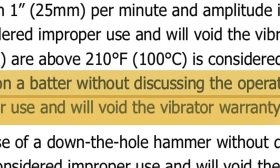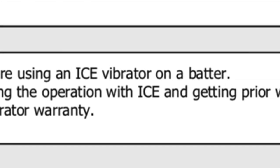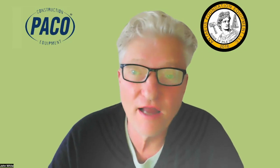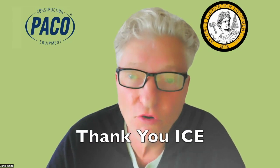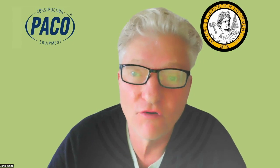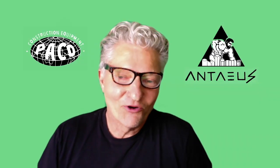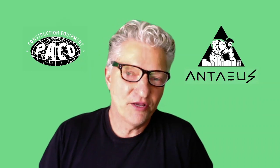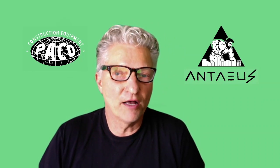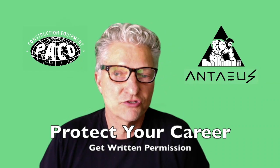When you look in the fine print of the ICE warranty, it clearly states that you cannot drive batter piles without written permission from the factory — otherwise your warranty is void. The manual also clearly states this requirement. This is not a criticism of ICE; in fact, ICE should be commended for at least notifying those who read their manual. Other manufacturers using the same bearings do not even provide that warning. So it's in the fine print — not everybody reads it, but now you are an informed pile driver. If you're going to drive batter piles or lean the vibro over even slightly, get written permission if that vibro has straight roller bearings.